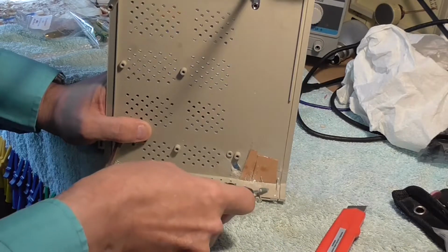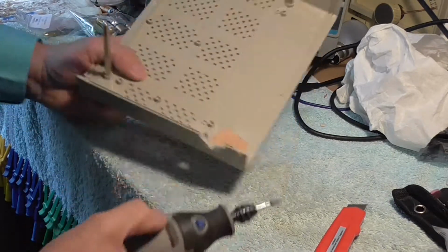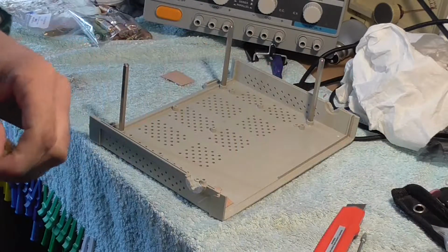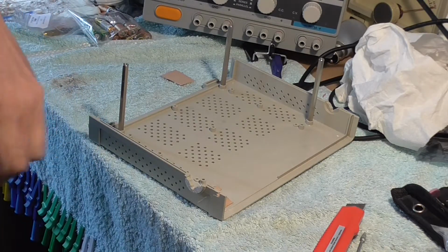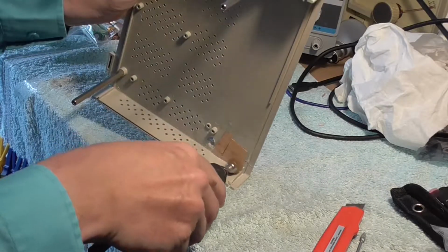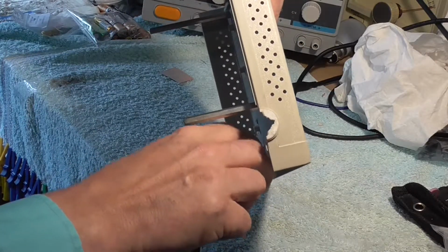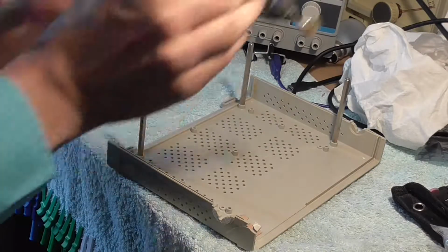Leave my finger. That's good. Right, now we're going to put the wire brush on it. Whoever invented this idea using a Dremel, what a brilliant idea. Fantastic. Nope. I'm just roughing up the plastic so that the glue's got something to adhere to.